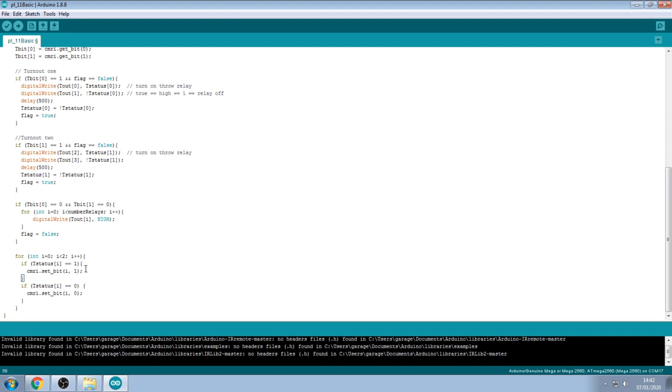If you want to use physical feedback, you can read the actual Arduino pins from the micro switch — say pins 50 and 51 — and instead of checking t_status, check whether that physical pin is high, giving you a real hardware feedback from the turnout position rather than just the code side. I'll try to get the full code on my website, including the physical pin feedback section. But feeding it back into the JMRI turnout status just wouldn't work — it didn't want to know.